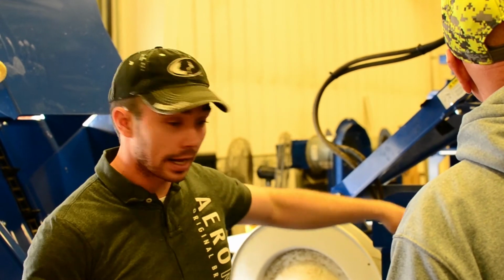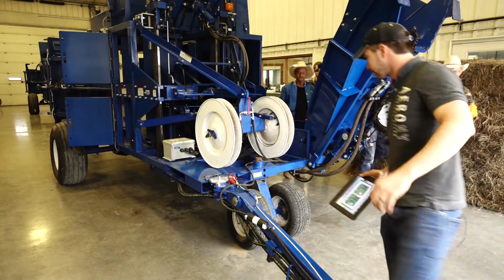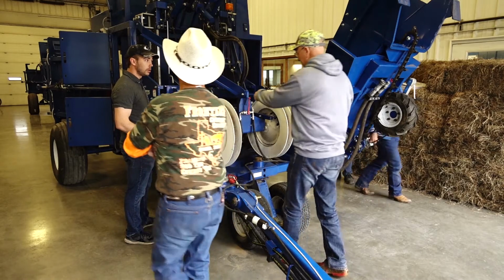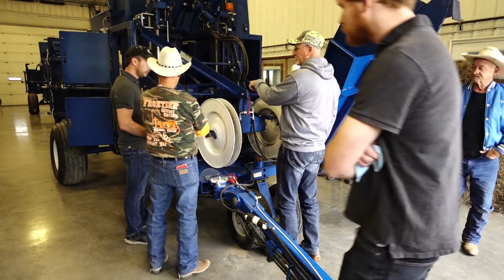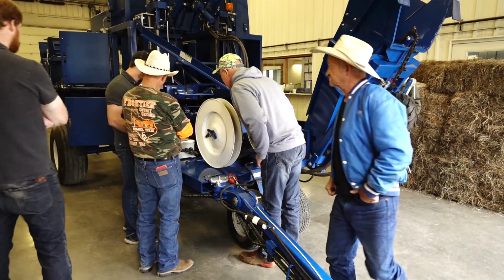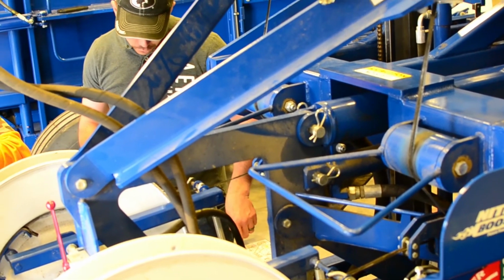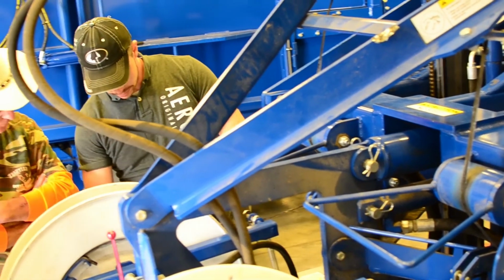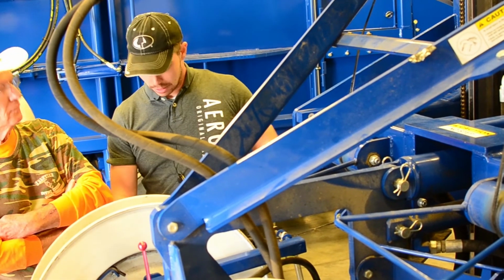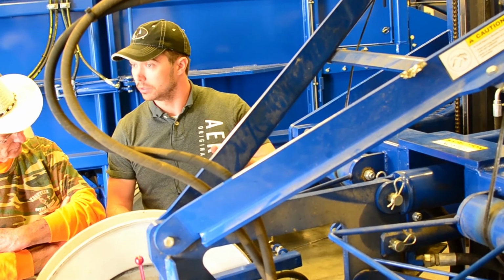Energized state, and I can show you here. So that's just on the solenoid. It's got power to the open side of the solenoid. Yes, and so look at here. See the vertical swing? It says number 2. The arrow shows the energized state. So the energized state of the vertical swing is open. And I know that it's energized by green 2. Now, if that was closed right now, and I knew I had power, and that says green, there's something wrong, so I'm going to look at that circuit. You see what I'm saying?